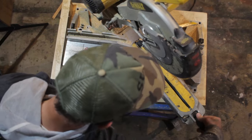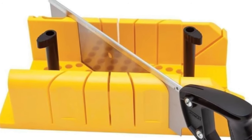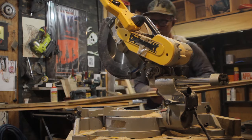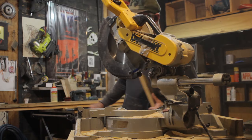It's time to start cutting our 45 degree angles for all of our corners. I'm using a miter saw, but if you don't have one, you can buy a cheap little miter box and cut these angles by hand. Regardless of what you use, you're going to want to make your cuts at a perfect 45 degree angle — as perfect as possible. An accurate 45 is your best way to get a nice square frame, because your two 45s are going to meet up at a 90.